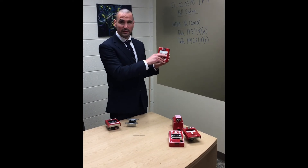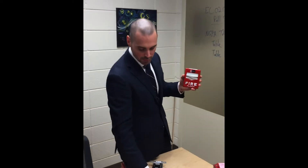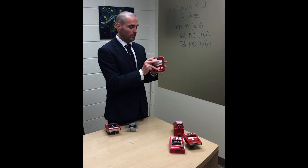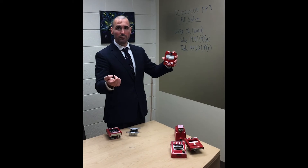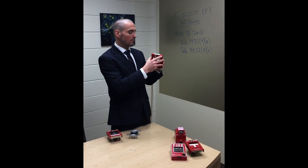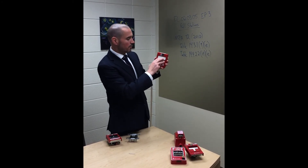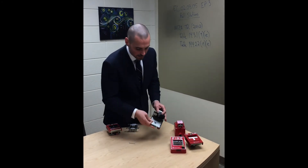These are a little bit different — they actually have glass or plastic breaks in them. Drew and I were playing around and accidentally broke the first one, so we put in a plastic one. To properly test it, you have to first open it up, which is going to set off the alarm, take out your plastic break, close it back up, and then pull it down. Similar to plastic, even though it's made of metal, it can still break. You have to make sure it locks into place — if it's not locking properly it can partially activate without fully triggering. Then you have to open it back up and put back in your glass break.